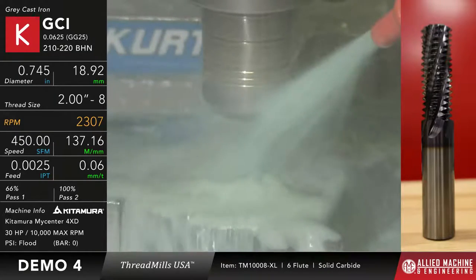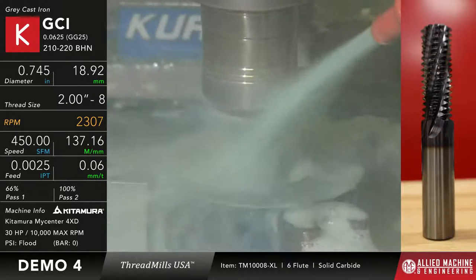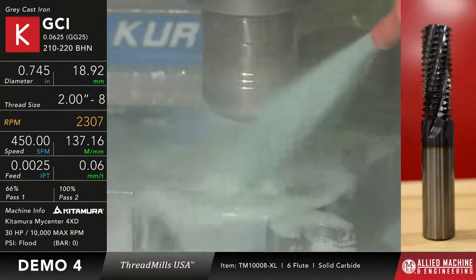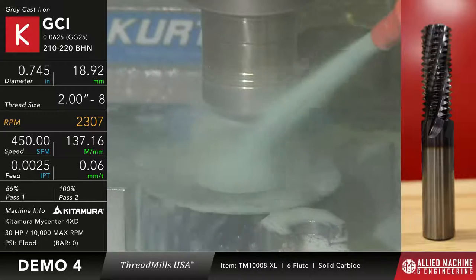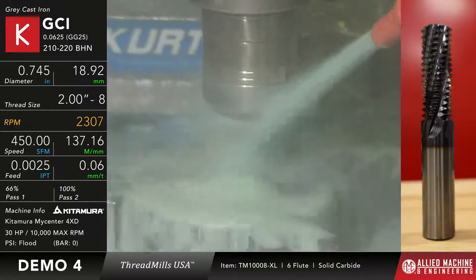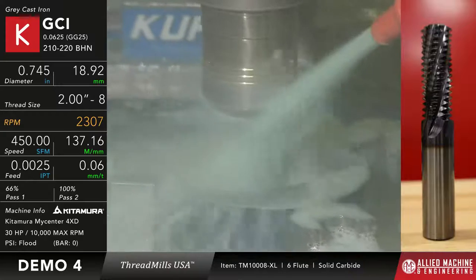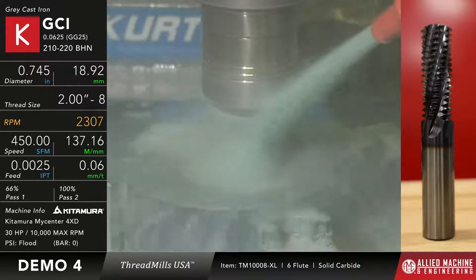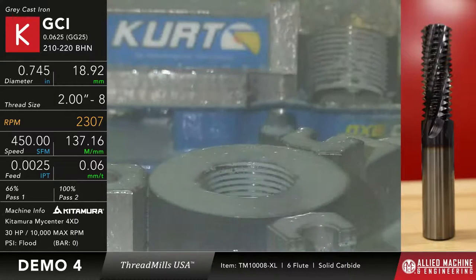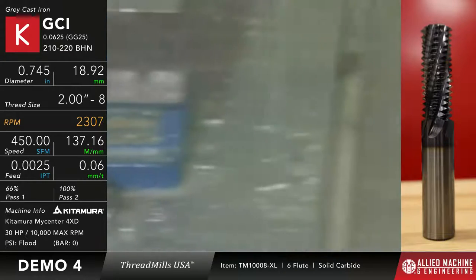Okay. So while we're talking about cutter compensation, the one thing we should talk about is our program coming out of Insta-Code is programmed based off of the center of the tool. That means that the helical interpolation that tool's doing is based off of the center of the tool. What that means at your machine is that you're not going to need to put a cutter diameter in your cutter diameter spot in your offset page. You can use the cutter diameter spot for your compensation. So depending on how the program is that you're using, but our Insta-Code is going to program based off of the center of the tool.